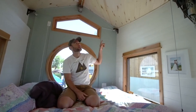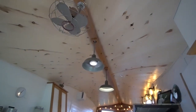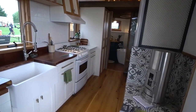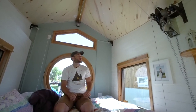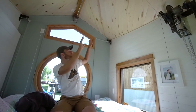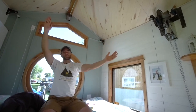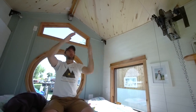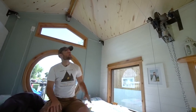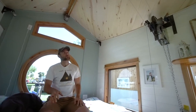The ceiling is locally milled aspen shiplap — not an off-the-shelf product. With this curvy roof you need a wood that can twist a little, so it's thin to conform to the roof shape. Because we have a warped surface, I couldn't run the boards straight across — the rafter length continuously changes from about 42 inches to 52 inches. The trick to get around that is to run them at a 45-degree angle, so they start in a corner and wrap around to fit the shape. That's why you see them at an angle.